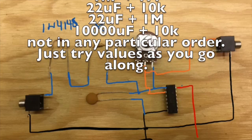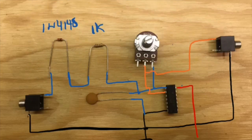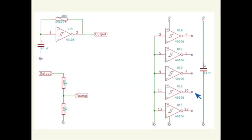And also, before you continue, you need to add one capacitor from the ground pin up to the plus pin of 0.1 microfarad, and this is to remove some of the spikes over the power rail in this circuit when the oscillators go up and down, which on the Hackaday page you can also see in the schematics here, from ground to VCC 0.1 microfarad.